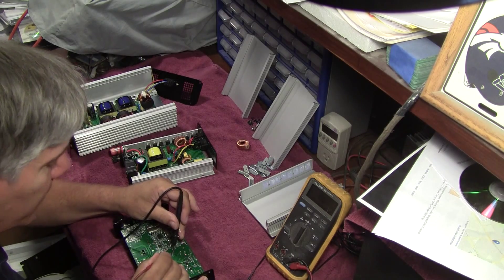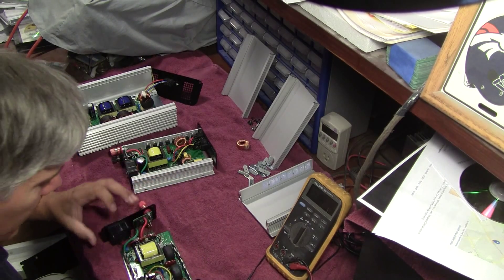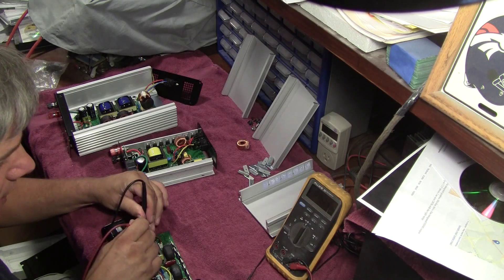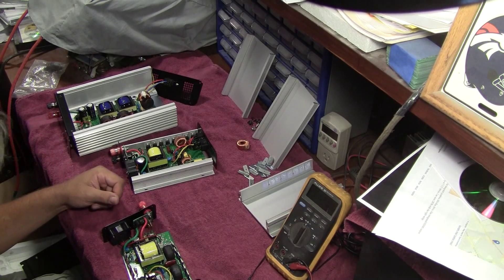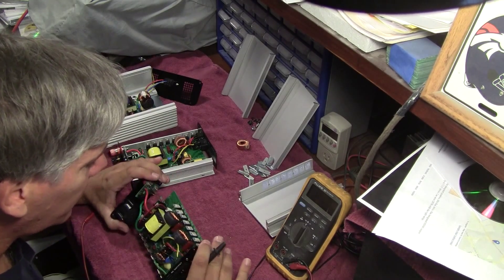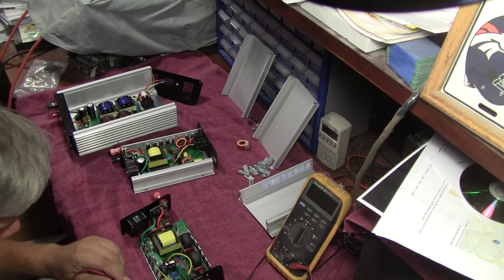It's open — we have an open fuse. That's pretty easy. There's another fuse, a blade-style automotive one, that can actually be removed, and it's showing very low impedance so it's in good shape. The AC side of this thing popped, which tells me there's a bad FET somewhere, or possibly a diode. This row over here is all D-designators — D30-something, 3940, et cetera — so we'll check those last.